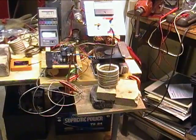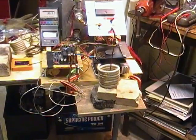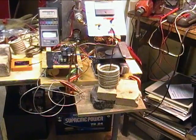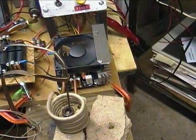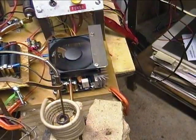I'll have to deal with how to make better connections there and try this again. We're now 50 seconds into the test — 412°C, still rising fairly rapidly. Down to 8 amperes, 36.2 volts. I'll turn the incandescent light off; I really don't see any glowing — well, maybe just barely to my naked eye.